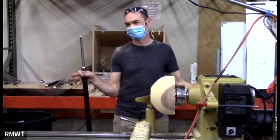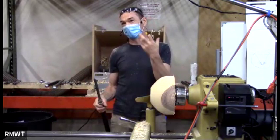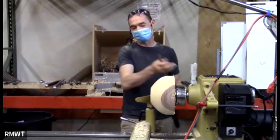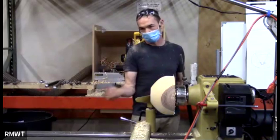But Mike Mahoney also starts at a lower grit than me, like 80 grit, because you'll say, I can't get as good a finish, but I get the option, when I flip it, of turning from the chuck uphill left-handed. And he does it left-handed from the chuck upwards. I don't have that option. Once I get it in the chuck, if it isn't running true, I've got a problem. So he doesn't have that problem. If it's running out of true, he just trues it up again.